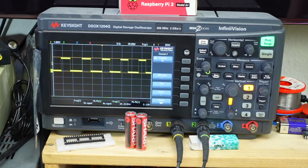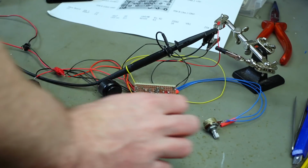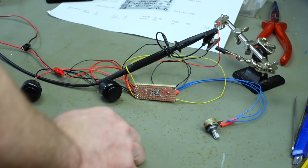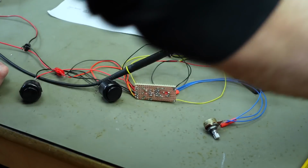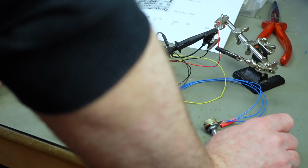This is the potentiometer changing speed, basically. This is super clean. This is kind of amazing. Yeah, this is a convincing Autofire circuit. And I suppose my 20K instead of 25K potentiometer is going to do fine, judging by the speed of the LED. Yeah, 25K is what was specified in the circuit, but 20K should be super fine for this purpose.